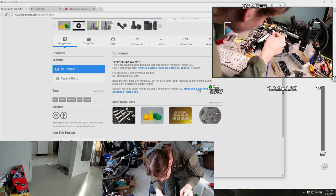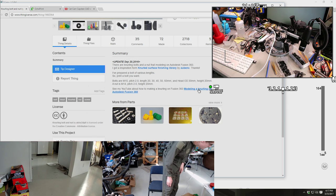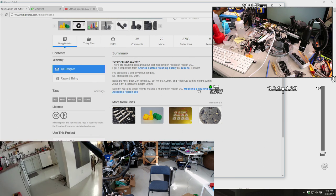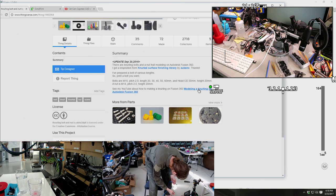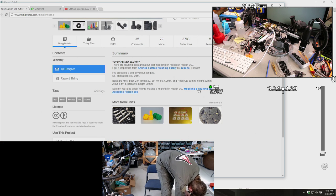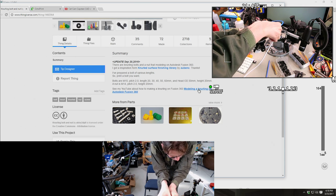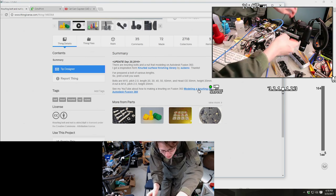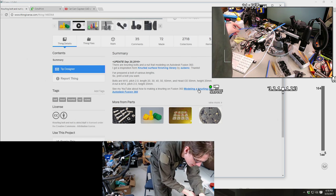That totally kind of fits. I mostly just need this to start the software on there, and then I want SDI video. Take Go, I'm gonna steal your video cable. Video cable. And 5 volts for the Raspberry and 12 volts for the camera plus gimbal. Well, camera, gimbal, and LiDAR are all being powered off the 12 volts, rather.